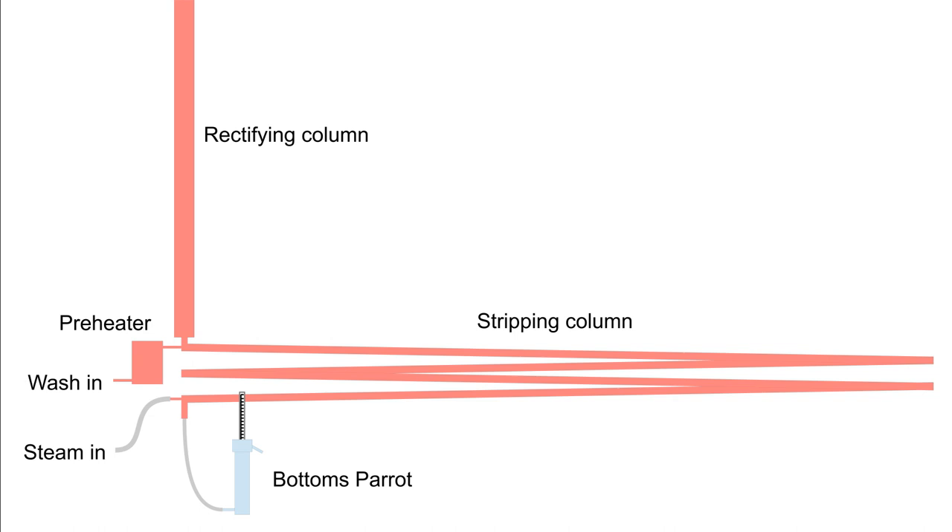Another advantage of the sloping tube is its relatively short vertical height. The rectifying column I use is a piece of 28mm copper pipe, about 2m long, filled with stainless steel spiral prismatic packing. A matching stripping column would be even longer, so the combination would be way too tall to fit in a shed. I have tried to use the same idea of a sloping tube to make the rectifying column, but have not had much luck so far. I will post another video if I manage it.